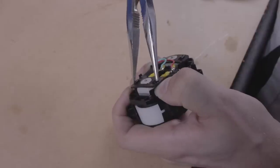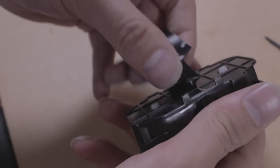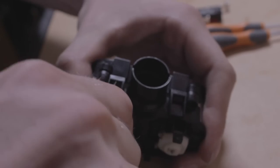The whole point of this mod is to upgrade the motors. Remove the back straps and snip off the connections. Before we can separate the halves, remove the rubber shroud. Then use a screwdriver to press out the four tabs that hold the two halves of the cage together.